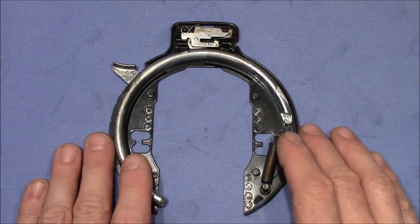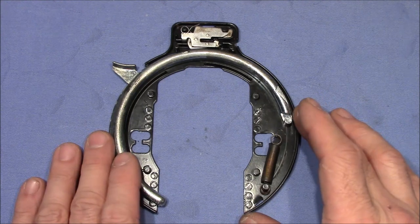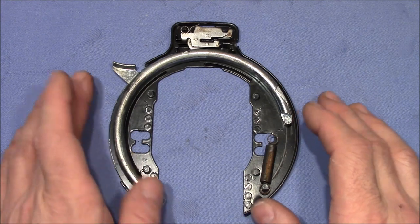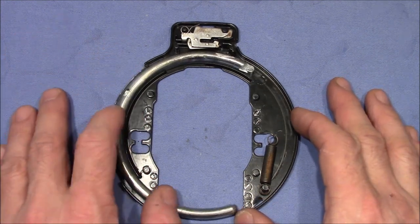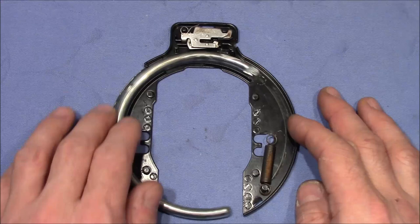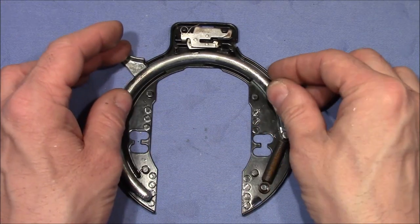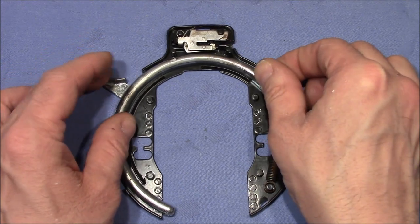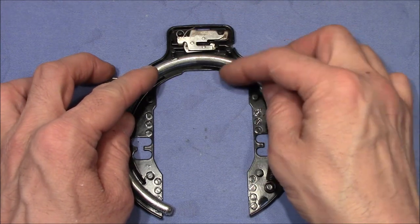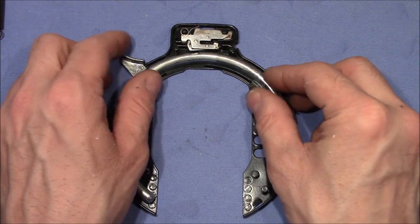I had to put the parts back in place to the best of my ability — hope this is all correct. So let's get started. We have this round bolt here, this ring here to lock up the wheel. It slides inside a groove and there is this spring attached, so it's under spring tension. When you push it down to the locked-up state it stays under spring tension, and when the locking mechanism releases the ring it automatically retracts.